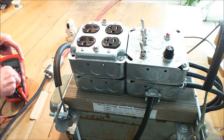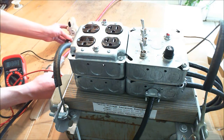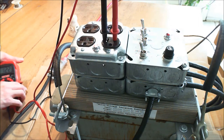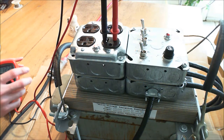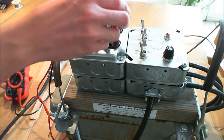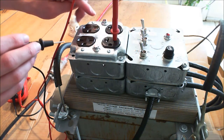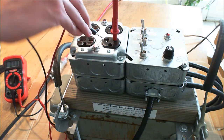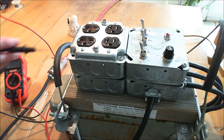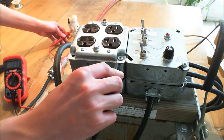I've already verified there's no voltage between here and here. Just to prove this is earthed, I'm going to switch to ohms and test the continuity between the grounded connector of the receptacle plug and the chassis. As you can see, it has a very low impedance path — less than a third of an ohm. So that's rightly connected, and this is connected to earth ground. I can prove that by probing the mains here: 120 volts between there. And connecting to the neutral gives zero volts, confirming which is which.